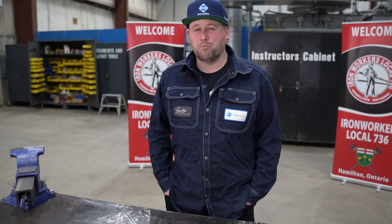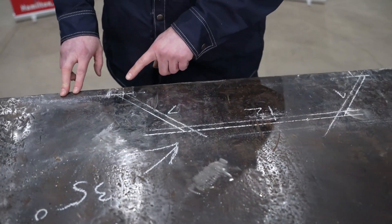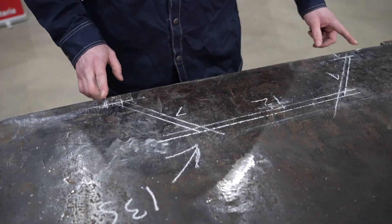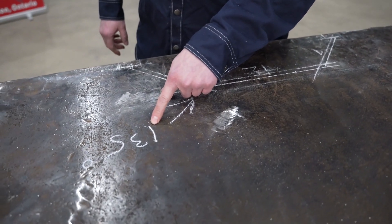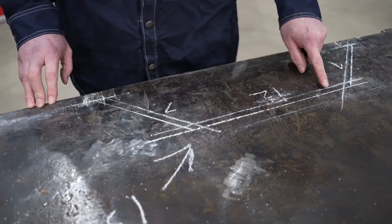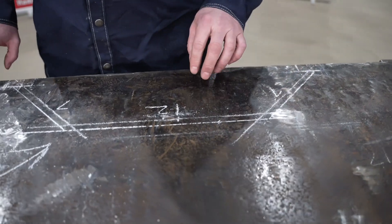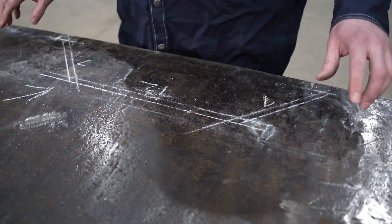You will have a print to work off of with cut lengths, but how did I get to that point? What I've done is drew in my inch and a half tubings at the span that I needed. I've used a 135-degree angle to keep it simple and drawn in my half-inch round bar at the height that I wanted. Then I pulled off my measurements and that's what we'll be cutting to. I will be turning this layout into my jig for bending the round bar.